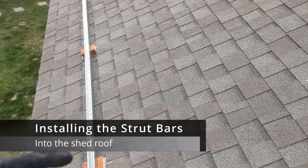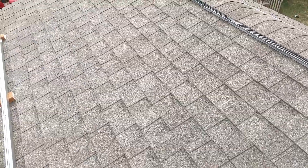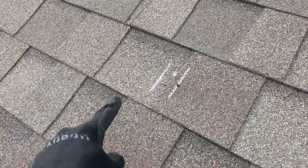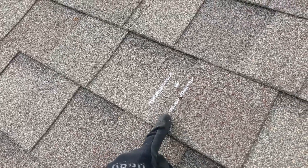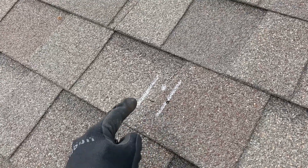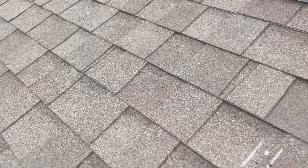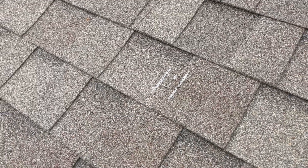I'm here on my roof. I already got three of the mounts done for my lower solar panels, and now I have to do the top part. The first step is to locate the rafter stud you're going to be attaching to. Some people hammer through to find it and feel where it gets solid. I have access underneath, so I came up with a very small drill bit next to the stud — I knew this was the edge, then I marked an inch and a half over, and then drilled out the middle. The next step is to drill out the hole so I can put my lag screw in.